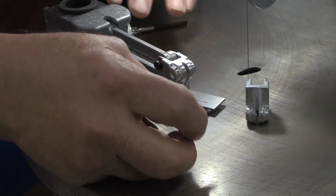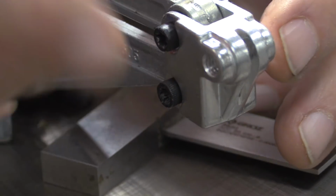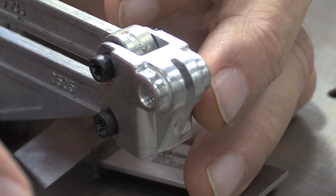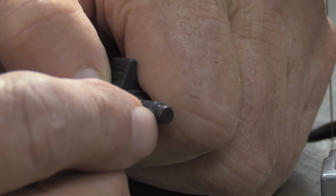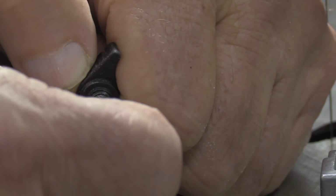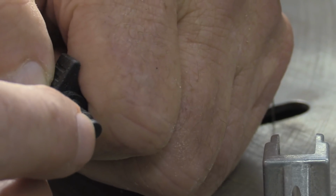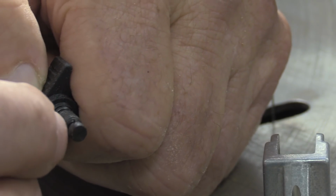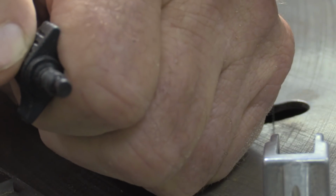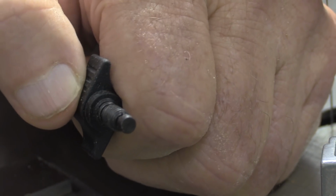You go ahead and take this blade clamp the rest of the way out, and all that's there is a set screw on the other side that's got a flat spot on it to back up against the back of the blade. One of the things that most people lose sight of is on the end of this blade clamp, there is a loose plunger there that I've just pulled out slightly. And you can see that this thing floats. It goes in and out. It also rotates, or it is supposed to rotate. Very oftentimes, people will forget that thing is supposed to be lubricated.